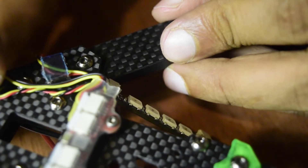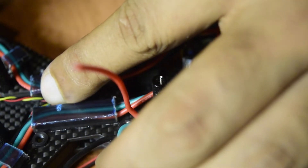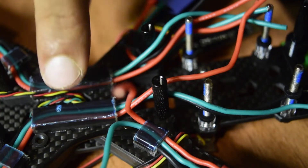Now let's do it for all four arms. The signal wire coming out of this LED driver is going to the front using this central hole. Here it is coming out on the front side - this is the red, black, and yellow wire. This is what will be connected onto the flight controller as per the connection summary I showed in my previous video. This is how it is installed.